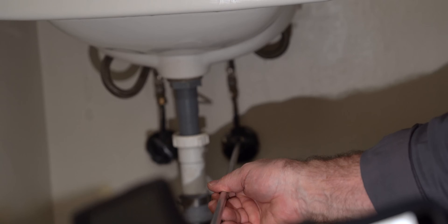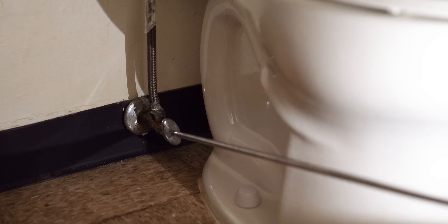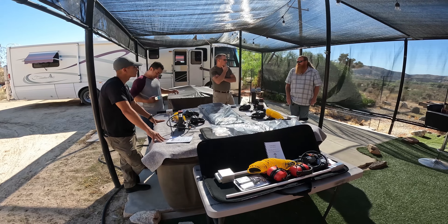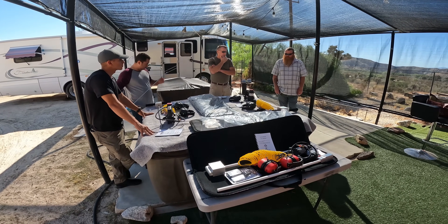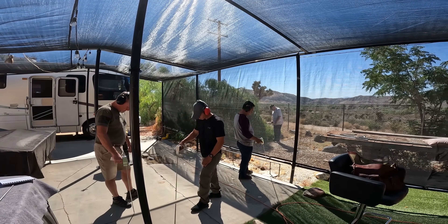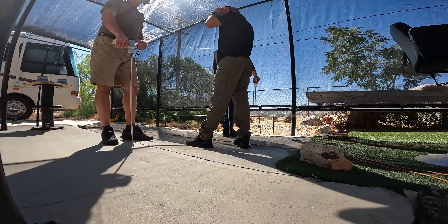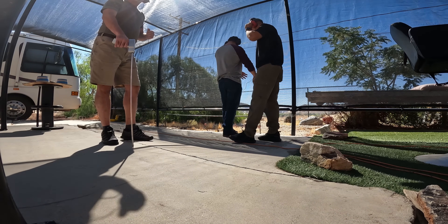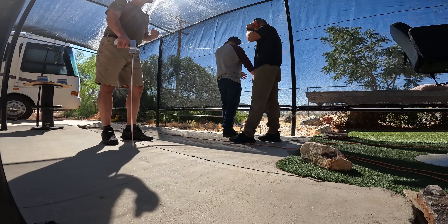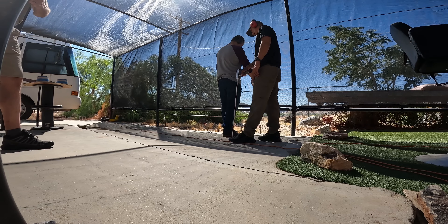Now I'm going to turn the water back on and go to every angle stop in the house. I want to turn my volume knob down just a little bit, put the tip on it, and go through and listen — that way I can determine noises. When we're doing training at the facility in Palm Springs, we have an introduction area: a water line running down with valves on it, a line that dead-heads, and leaks in different places. We turn on one of the valves and let the plumbers listen, and once they tell us which one is leaking the most, we say come straight out from there and listen on the concrete. When you're listening on the concrete, turn your volume up so you can hear what's going on underneath.